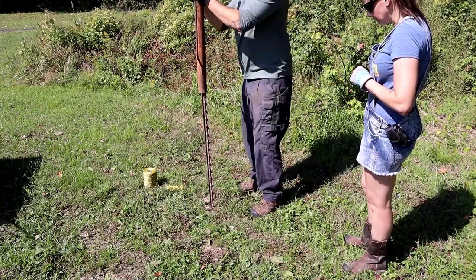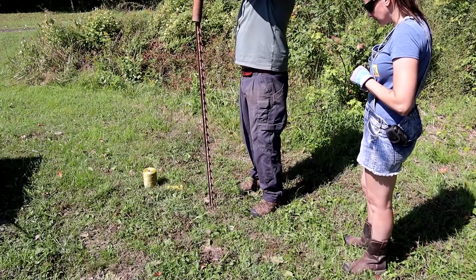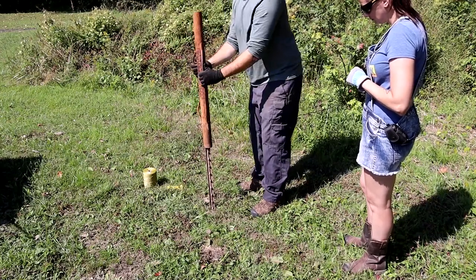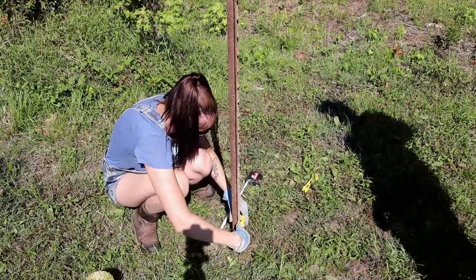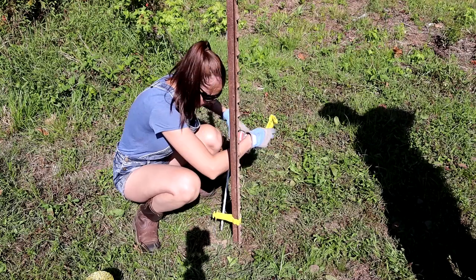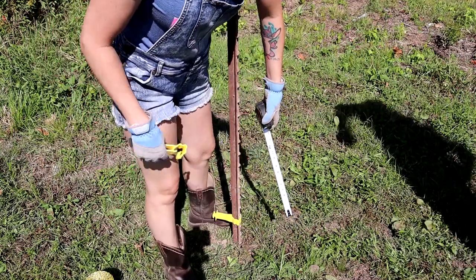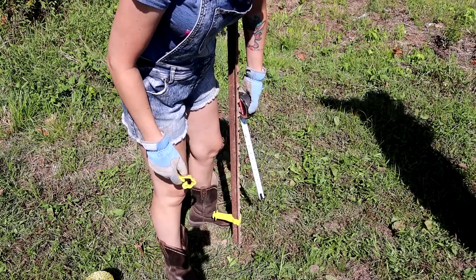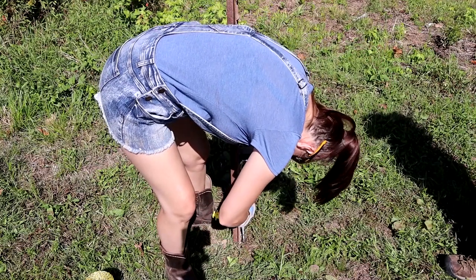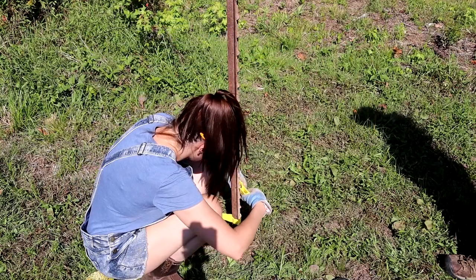So we did one corner, and then we went all the way over to the other corner, probably about 200 feet away. And what we're doing is we're pulling that line with us as well. Now this is electric wire versus electric strand wire versus just electric metal wire. We've used the metal wire before, and it kinks. It's hard to reuse, so we like the strand stuff. It's like rope. Yeah, it's called electric rope.